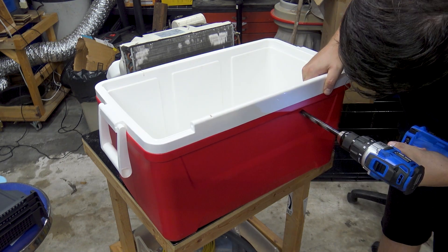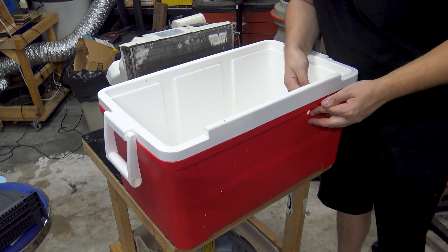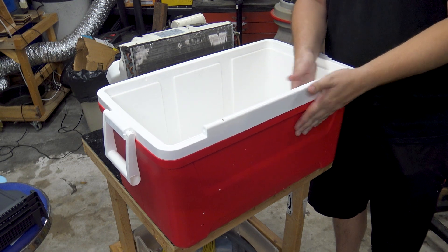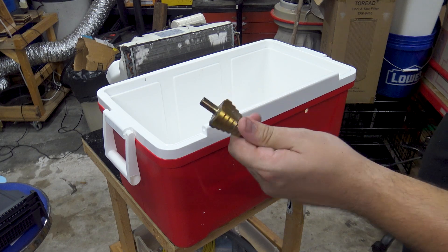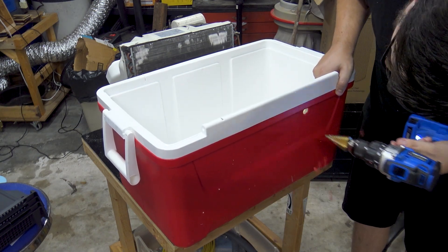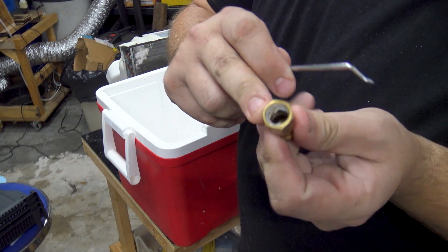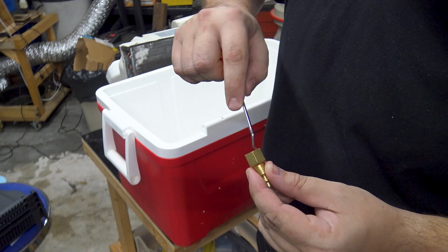I'm going to put it right about there. There is a decent half inch to three-quarters of an inch of distance between the inside and outside layers, and there is insulation in here — probably just expandable foam. I think I can get it done with a step bit. Heck yeah — that should be perfect. Got my dental tools. There's some old stuff in there, so we're going to scrape around so it gets a better seal. That ain't half bad.